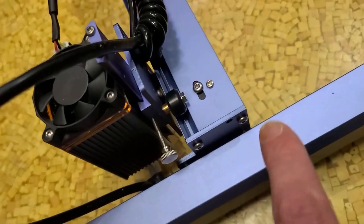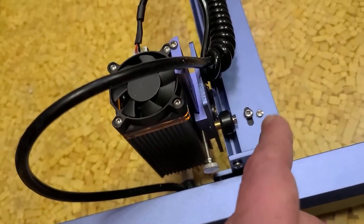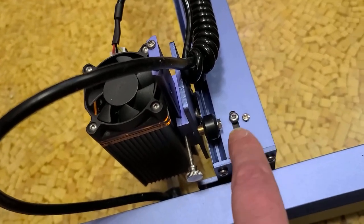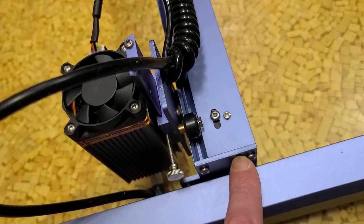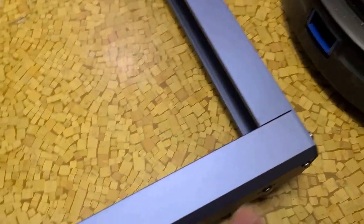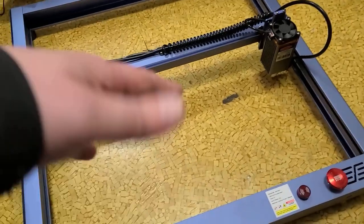And one last quick mention, really easy to set the tension really precisely. You can just feel the belt tension. They're tooth belts, so you just want to have enough tension where the teeth won't skip, but you don't want them guitar string tight. Really easy, 2.5 millimeter button head screw. Loosen that up and you use a 2 millimeter hex key through the little provided holes where all the tensioners are, and you can just slightly adjust the tension until it's just right. So super easy.